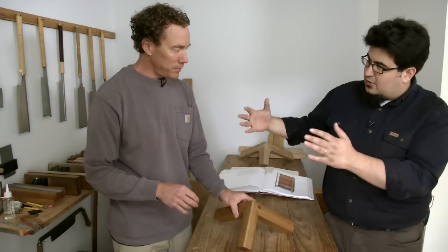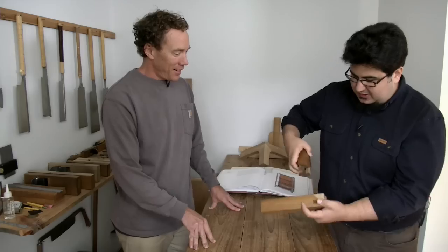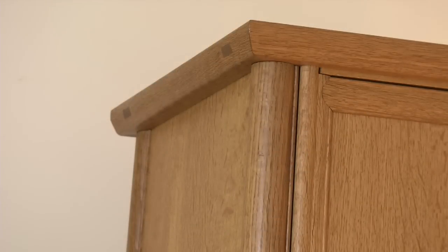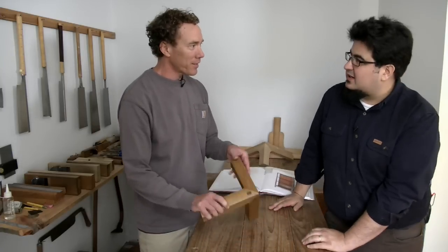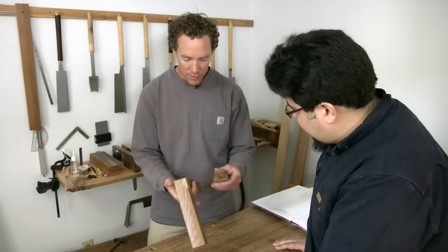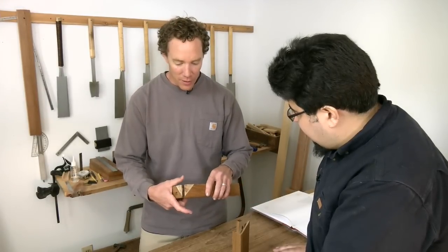If you had these on all corners of a piece, the final assembly would be a little complicated. I did a piece — an armoire — with this joint, 16 corners, well, eight corners in two pieces. The key is to get the layout from the very beginning and don't go past the lines, because you can't fine-tune it after the fact. The second you fine-tune one of the joints, it affects the one on the other side. Starting out with good layout, which is probably the hardest part of the joint. After that, it really is just woodworking — routers, drill press, a lot of hand tools to get the inside of things. Once you get your head around it, it's doable for sure.